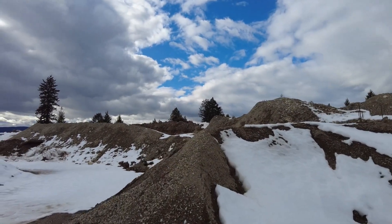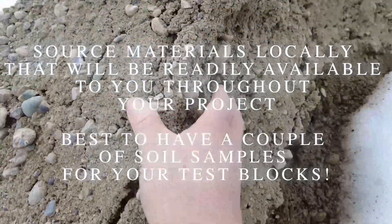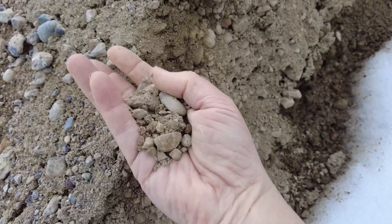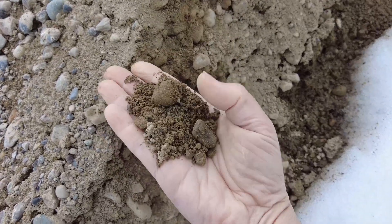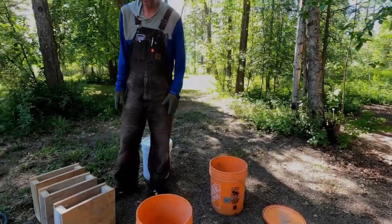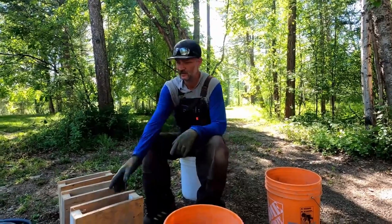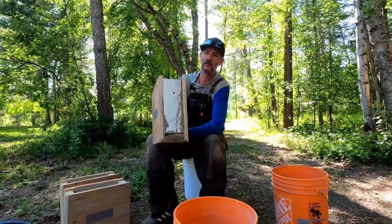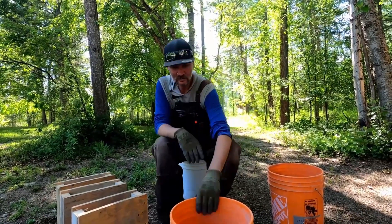Good morning — let's go! We are making sample blocks — sample two. What we're doing is making sample blocks for our rammed earth walls for our geothermal rammed earth greenhouse. We've got small formwork made up, just 2x4 width with plywood sides. We're going to ram it with a 2x4. We have our mix done up — just a dry mix.